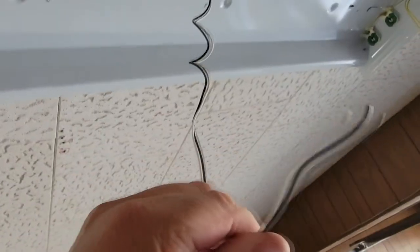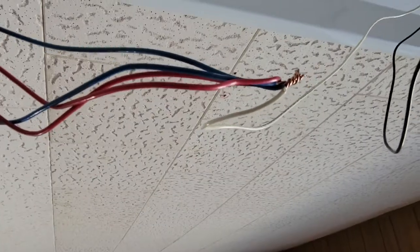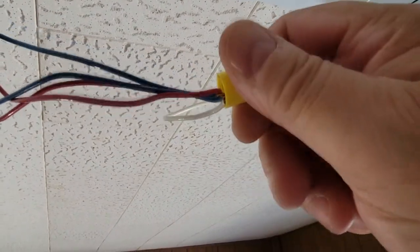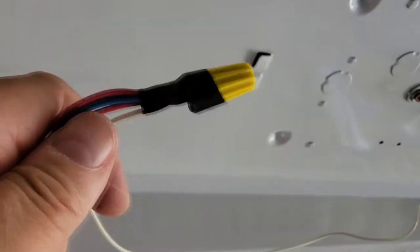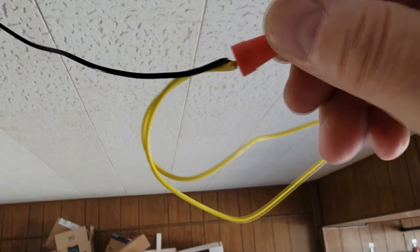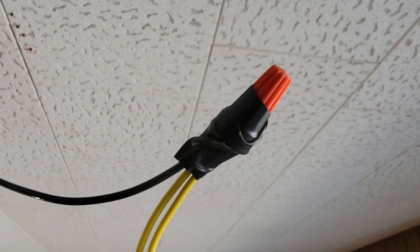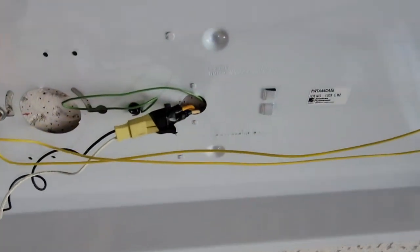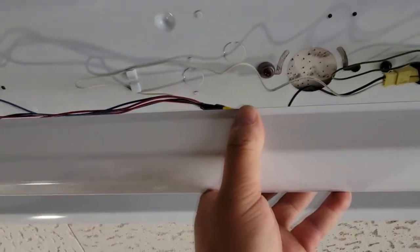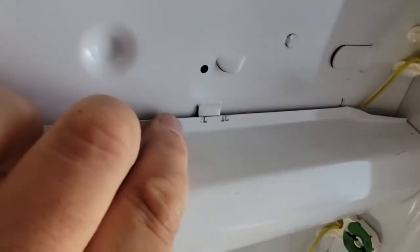Now you need to separate the wires. All the wires on the left side need to be connected to the neutral side, and all the wires on the right side of the fixture need to be connected to the line, which is the power line. You can put tape to make sure the wire cap won't back up and stays secure. After connecting the wires — left to neutral, right to the line — tuck them in and organize them under the cover, then clip the cover back on. Make sure no wire is protruding from underneath the cover. It's very simple.